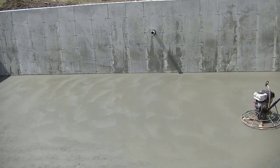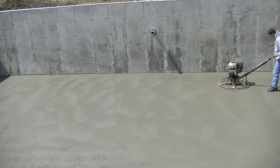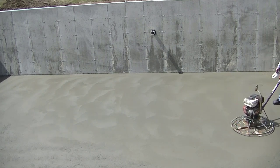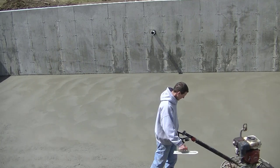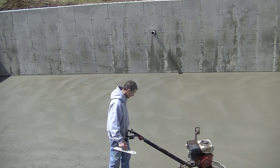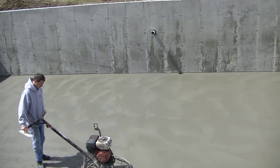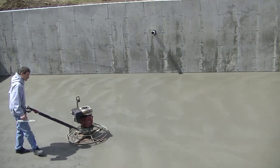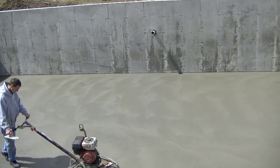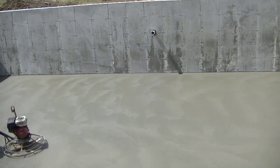I scraped up a little cream and filled in a rock hole right there. Now I'm going to work my way back and then come down and hit that one part on the left that's still a little rough. I'm just working my way back in a little pattern, hitting everything that's in the sun. There's still like three or four feet of that floor in the shade that I'm not going over — we'll probably hit that again by hand before we hit it with a power trowel.